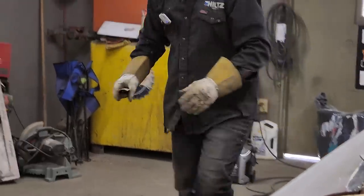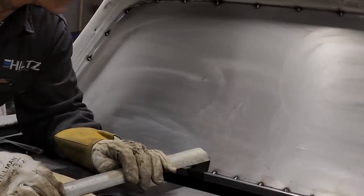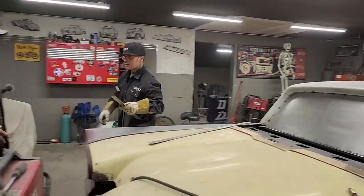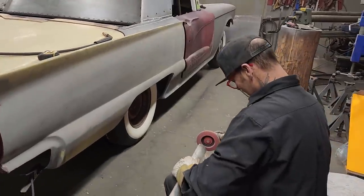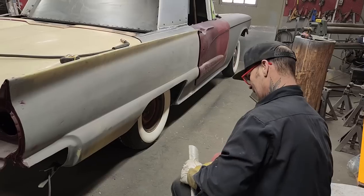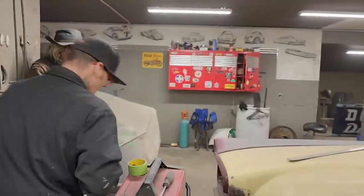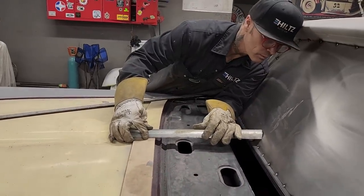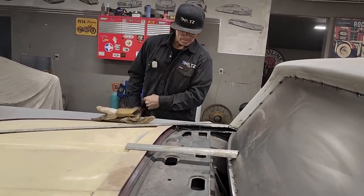So it is true — this stuff takes your brain away from other things if you're thinking about it. I kind of have a motto: if you're going to think about something, you might as well do it instead. You stay still and I'll just walk right around you. Just trying to get that to fit there — give me my marker. The same distance from there to there that's not fitting is where I'm going to take off where it's hitting. Basically that's how I scribe things — that's how I do it.